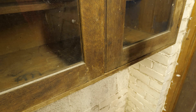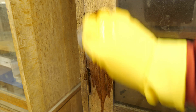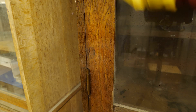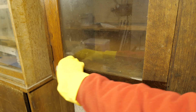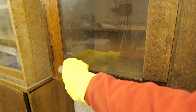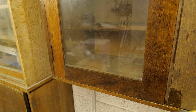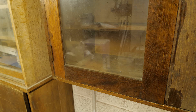The technique I'm using is from the English Polisher's show on YouTube, and I've used it a few times before. First I rub down the whole surface inside and out with denatured alcohol and fine wire wool. This removes any workshop oil, airborne dirt left from the welding that was done in here, and helps clean up whatever was spilt on the inside. It also rubs off the outer layer of whatever remains of the original finish, but stops short of fully stripping down to the bare wood. It's quick and easy to do, and very effective in cases where the old finish has been almost entirely destroyed. It doesn't work quite so well on furniture with a modern finish that's still intact, in which case it may be necessary to strip the finish before restoring.